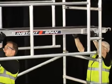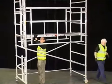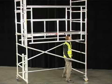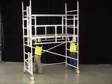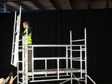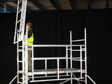Standing inside of the tower, fit two platforms. Fit the trapdoor platform on the 5th rung of the ladder frame with minimum gap between the platforms. Ensure trapdoor opens outwards. Fit the second platform beside the first one. Lock the two platforms to the frame using the wind lock system. Access to the platform is forbidden unless the Advance Guard is correctly fitted on the frames.